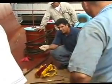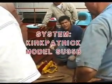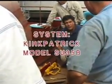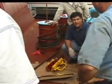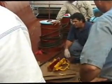Then we'll just adjust the throttle, so to speak, on the flow control valve for what we see coming on the rope. We're just getting a nice, light, even coating. The groove cleaner will do its job on the entry side and clean the rope. And then we'll adjust how we do the flow.